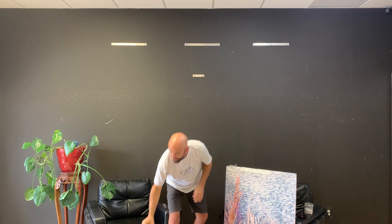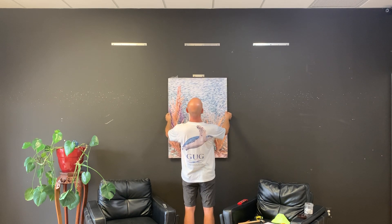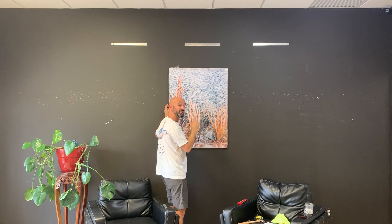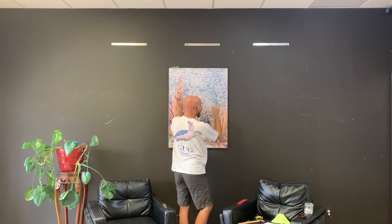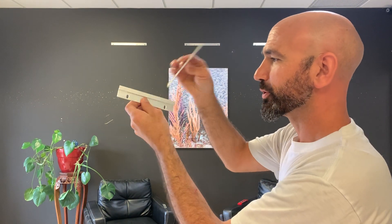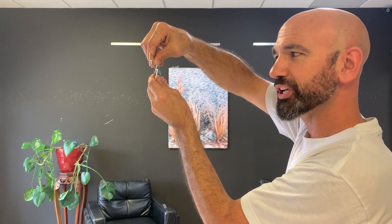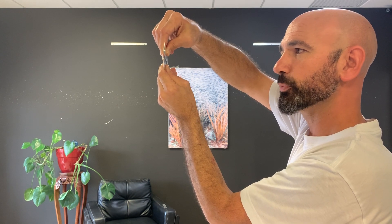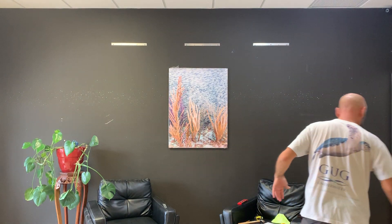Give it a jiggle — good to go. Now watch how easy putting this art on the wall is. You go up, slide the cleat past, then drop it down until it clicks in place. Before letting go — especially on a big piece — give it a jiggle to make sure the two identical cleat pieces are slotted in right next to each other. You want to confirm the art is hanging flat against the wall, not tilted forward at the bottom, which could cause it to fall.